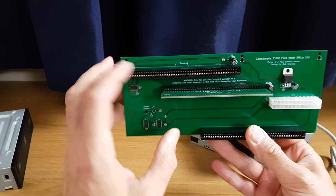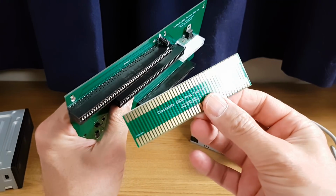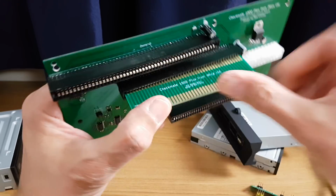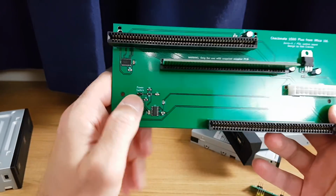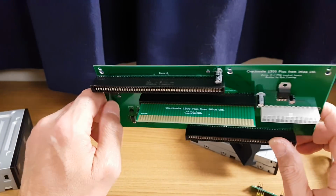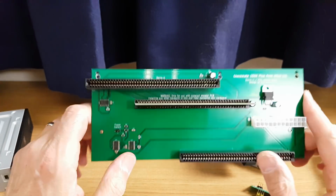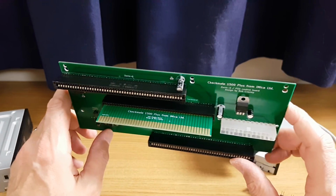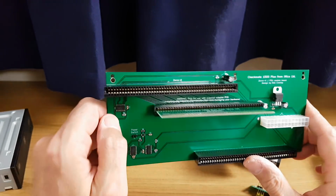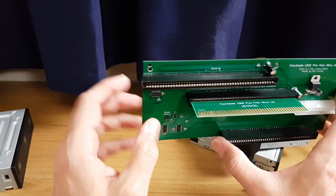So we've got an 86 pin connector. Now you do have to run this little card. Okay, it's a double-edged connector with nice gold connectors. You do have to put that in there, and then you can plug in things like your ACA 500 plus. You can plug in the Witchers. I mean, even an A590 could plug into that. Although to be honest, they're so valuable now, I wouldn't take it out of the case. In the old days, we used to take them apart and didn't care, but nowadays they're worth a packet. And then obviously in here is a 100 pin Zorro slot.